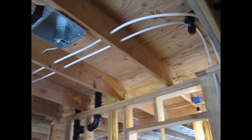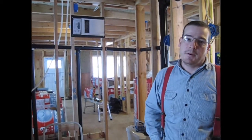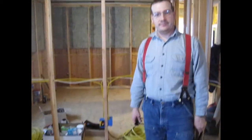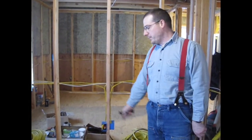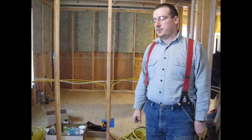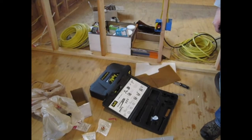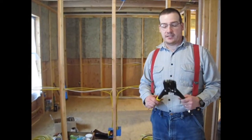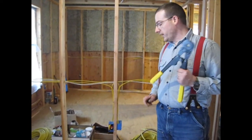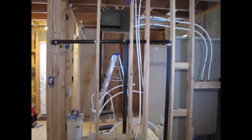We got the main trunk run. We just bought white PEX pipe — I know it comes in red and blue, but we just bought white because that way we only had to buy one roll, and you can't see it when it's covered anyway. How many PEX crimp toolkits do you need? At least two — or actually just one that works. The first one we bought would over-crimp, going too far into our go/no-go gauge with no way to adjust it. Virginia ran to the hardware store and bought another kit that tested properly. While she was gone, I started roughing in some more lines and used colored tape to mark hot and cold.